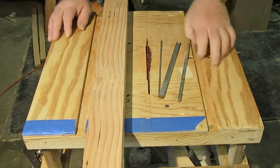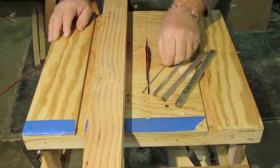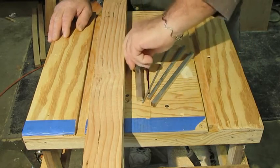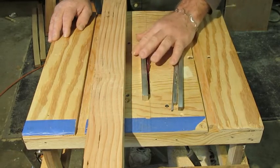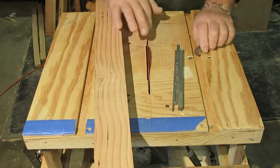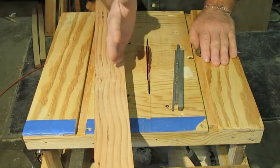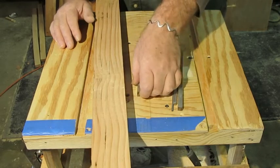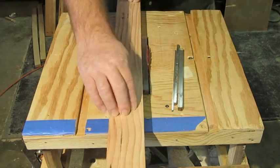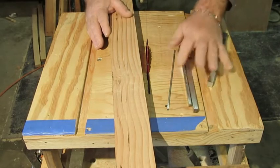These are simply some pieces of steel bar stock that I've checked the measurements on and they're very, very accurate. They go in one-eighth increments — so I've got an eighth, a quarter, three-eighths, and a half. To set up the blade and the fence, I can make sure that I've got it on tooth. I can account for blade wobble, because circular saw blades do tend to wobble a little bit back and forth. So I want to make sure the wobble is closest to the rip fence. For a half-inch cut, I can set up like that, clamp it in place, and I know I've got a half-inch on the leading edge and trailing edge. I can do that all the way down to an eighth of an inch.